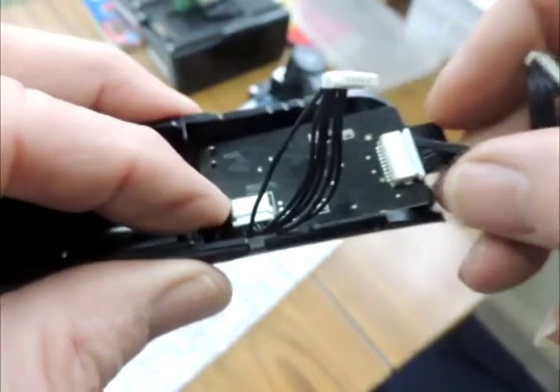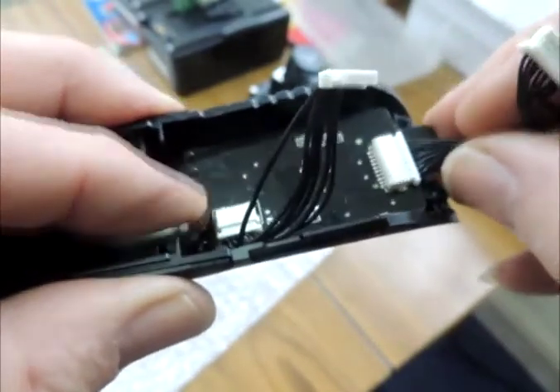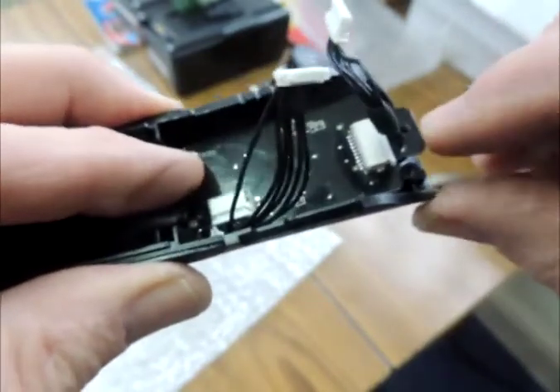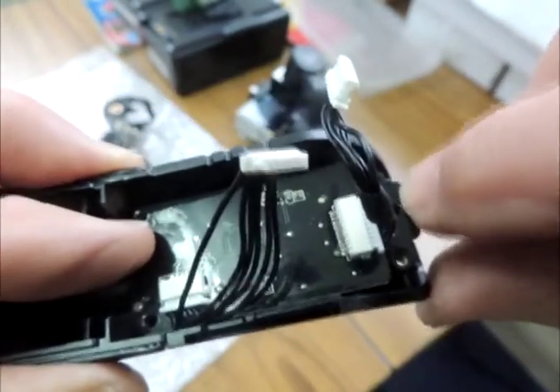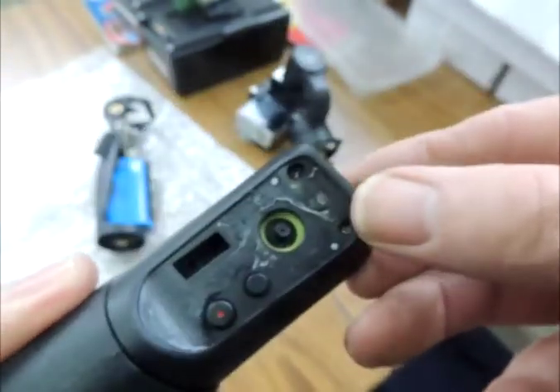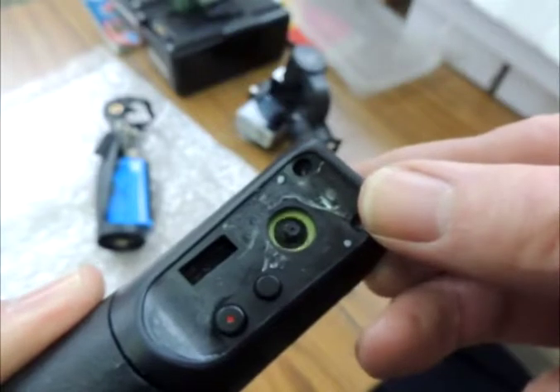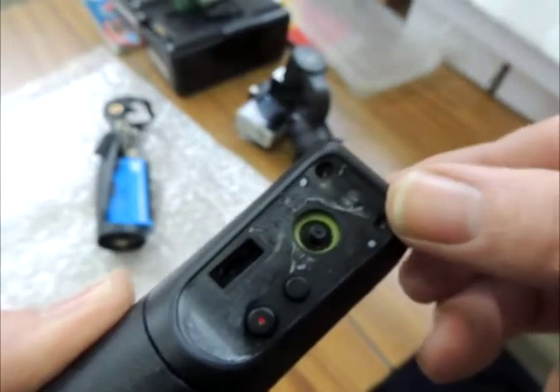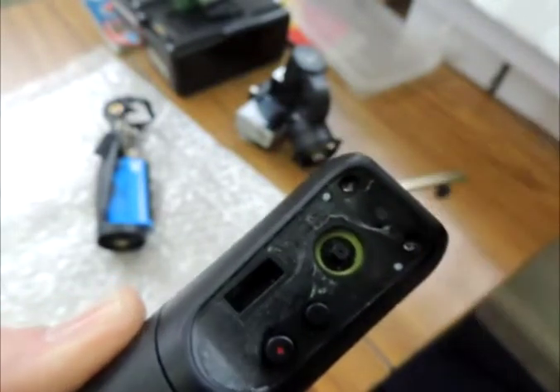Location wise: one, two, and the third. What we need to do is there's a little bit of play allowed. We need to increase that amount of play by elongating the hole where my fingernail is. That will allow us to relocate it such that the board is then in the centre, which was preventing the pan right operation. So once we re-centralize that, all should be well.